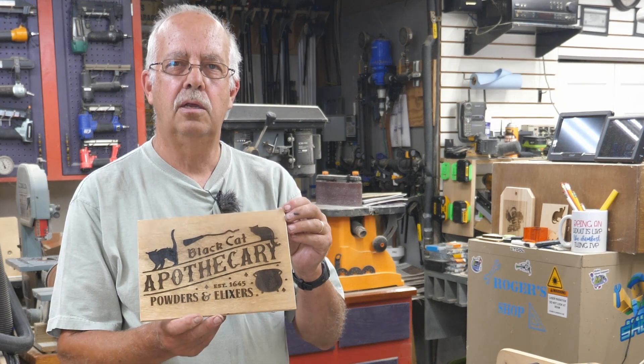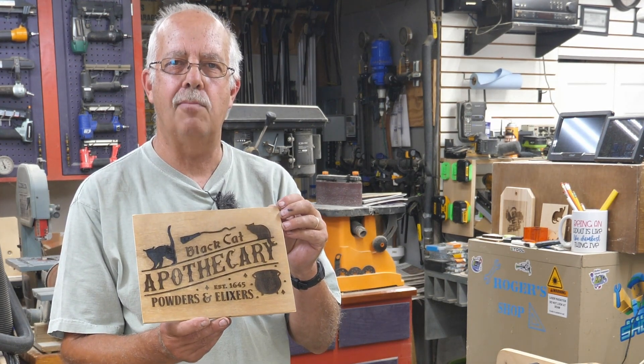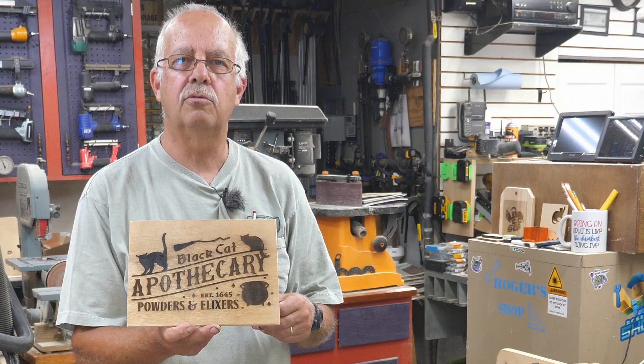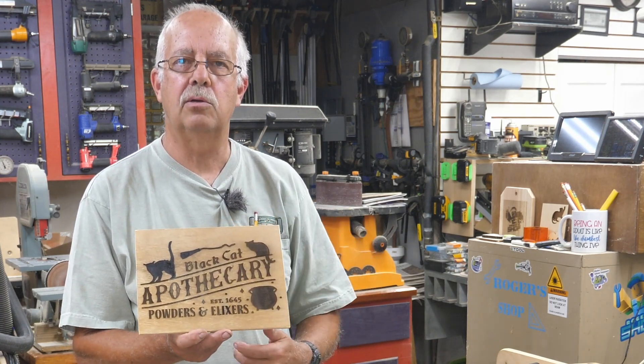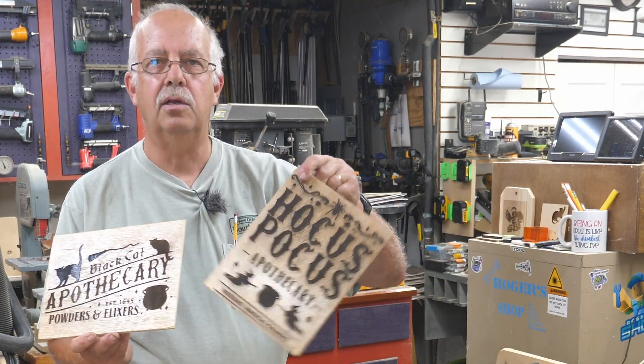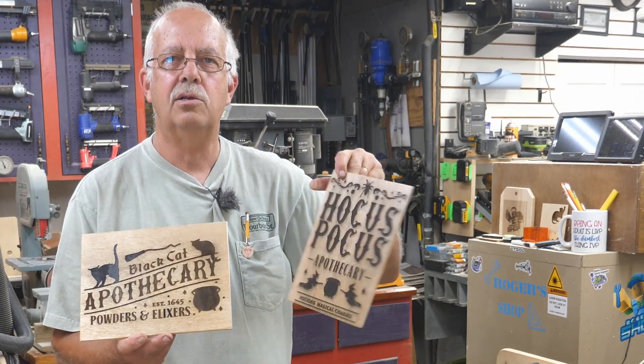Once you've got that antique look, coat it with either polyurethane or, if you want a really amber antiquey look, use spar urethane varnish. On your first coat, always use a spray — if you try to brush it, you're going to have a smeary mess. I always use Helmsman spar varnish spray. Let that dry, then if you want more coats you can use spray or brush. There's one example, and this one's already been coated — a couple spooky antique-looking things for Halloween. I used the xTool Ray 5 laser and I like the machine — there'll be a link in the description.